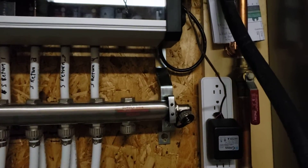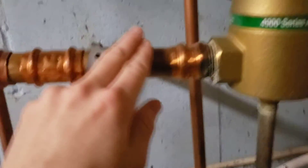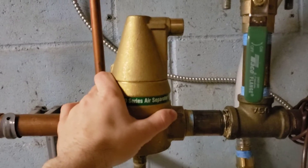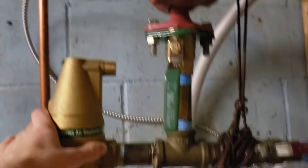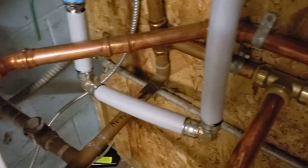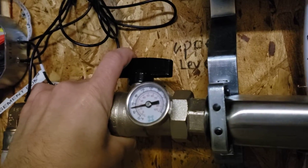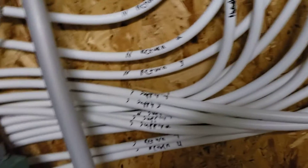To show you how this is all connected before we get into how the cross manifold works: here we have our boiler, and this line down here is our supply line, which carries the hot water from the boiler. Up here we have an air separating unit to get air out of the heating system — that's one of the biggest culprits for problems with your heating system. Then we have a circulating pump. This one is actually pumping up, but the pump we're looking at today is this one down here because this is what's pumping down through that pipe. So we're still on the supply side, up through here, and then it supplies right into here. Here's the valve to close off the supply, and here's your supply hub line, and then you have all these supply lines that come down here.